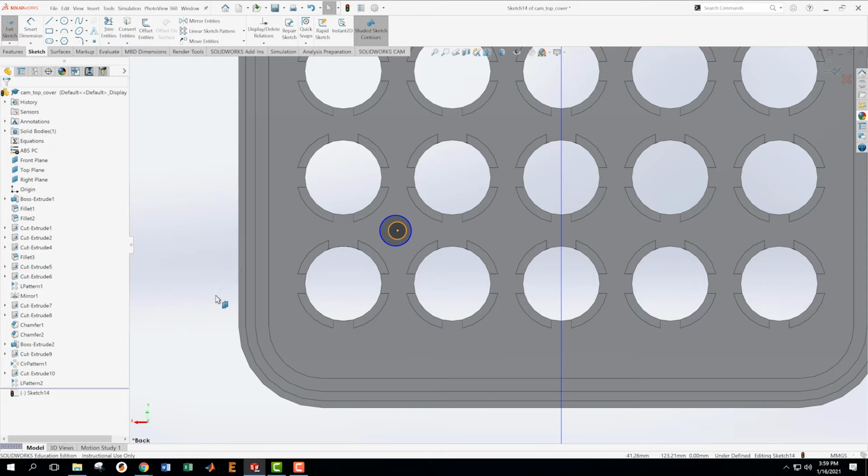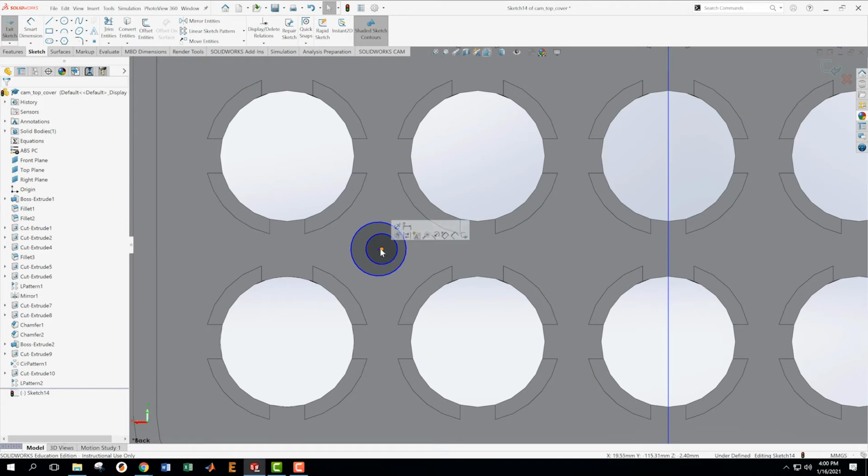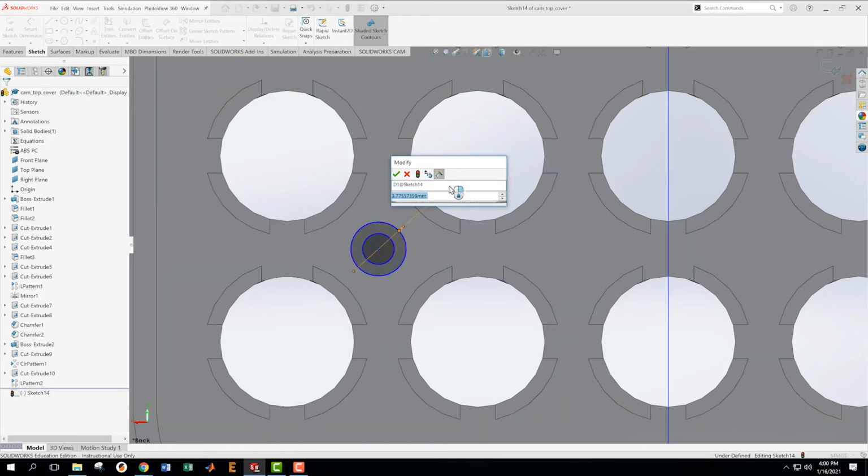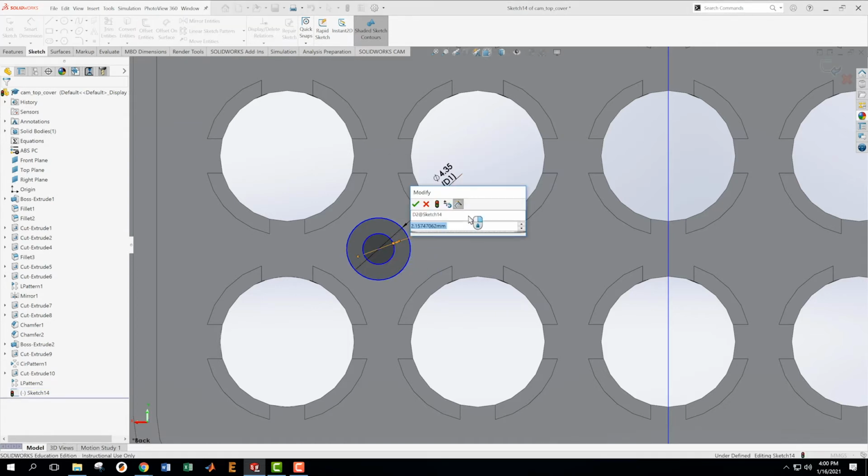And then I just need to get the diameter of those posts. Okay, here we go. Detail Z, detail Y. Detail Y is what I need for that post. So, here we go. These two, we need to first make them concentric. Grab their centers. Okay, I could make their centers the same, or I could make them concentric. So, I'm going to make their centers the same. I'm going to dimension now the outside 4.35 and the inside 1.94.